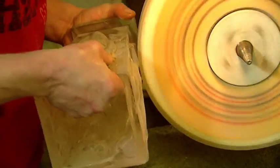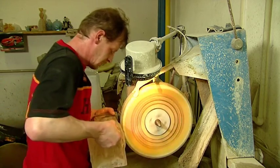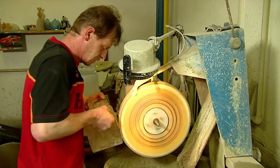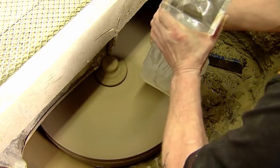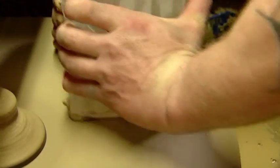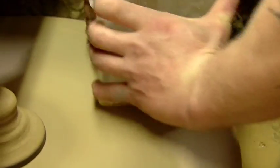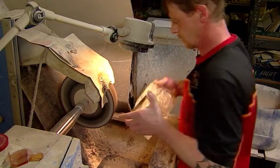We already know Scheibe, the horizontal disc grinder. We need it now for further perfection of the glass wonder. The crowns and upper parts of the products have to be polished until they're smooth and shiny. A horizontal foam disc smooths glass with pumice and water. The groomed glass is almost ready for shipping, unless designed for painting.